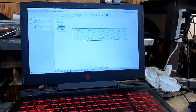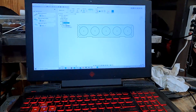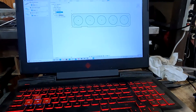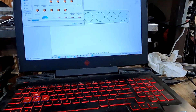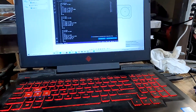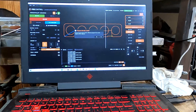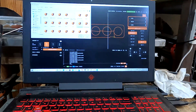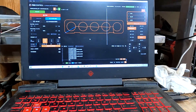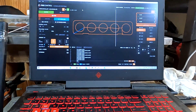Here's one of the parts I'm going to cut out. I'm not going to go through all the steps on how to draw this up in CAD and write your cutting profile — there are plenty of really good tutorials online and I followed those with no problem. But here is what I want to cut out. I'm going to save this and write my G-code for it — pretty easy. I have it pop up a window so I can look it over and make sure everything looks okay. Then I'm going to go over into FireControl, open this up, set my origin, get set up on the table, enable the torch, and go.